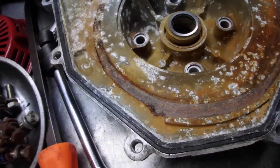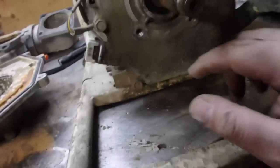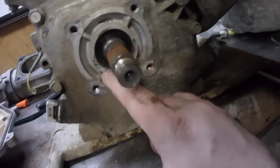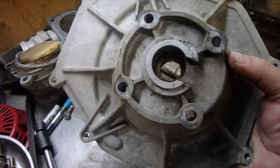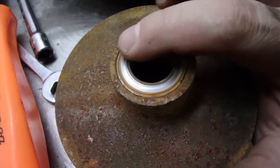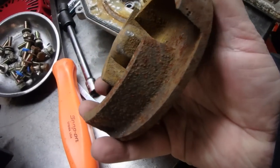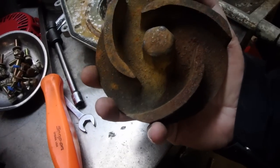As far as the pump housing looks, it looks pretty good — I'm not seeing any cracks. The mechanical seal looks good on this side. There's no evidence of the seal leaking past, because that's the last thing you want. Otherwise it'll leak behind here and could get into your crankcase. Unless, of course, this was designed with a weep hole — and yes, it does have a weep hole, so it would leak right by. That's a pretty smart design. Now on the impeller, if you look closely, there's a crack there, a crack there, and a crack there. So this mechanical seal — the ceramic part — should actually be changed out. Looking at the impeller itself, there's not a lot of signs of cavitation or heavy wear. The impeller's actually in pretty good shape.